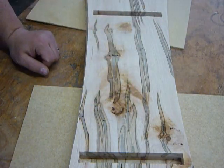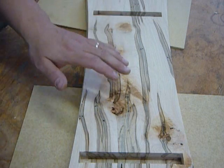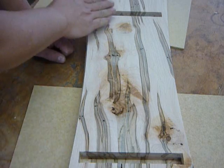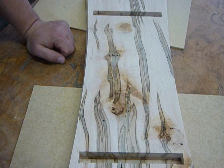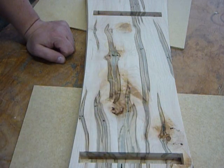It's actually tearing them out. So this is the bottom — luckily the top didn't have any problem with it. Being that this is the bottom, there's really nothing that you can do about it short of sanding it out, and I didn't want to thin the top down any more than what it is. So what I did was just filled it in with a little bit of epoxy and let it cure overnight.